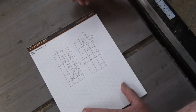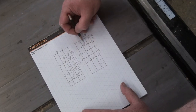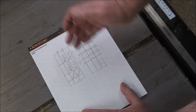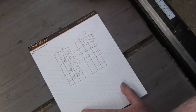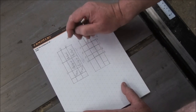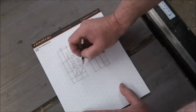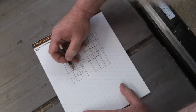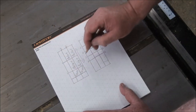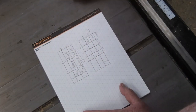Okay, so if I were to cut these the other way with the long cover dimension this way, I could get 10 out of this sheet. Just that then the grain would be going the way that I don't want it to go. So with the pallets, we have a similar situation. I could get 5 pallets out of here if I were to cut one this way at the bottom. So that's not too bad. I've done that a lot. So then you get 4 pallets going the correct direction. You get 1 going the direction that I don't prefer.